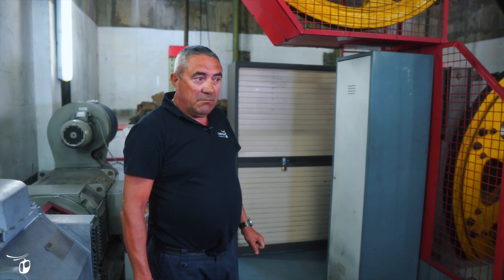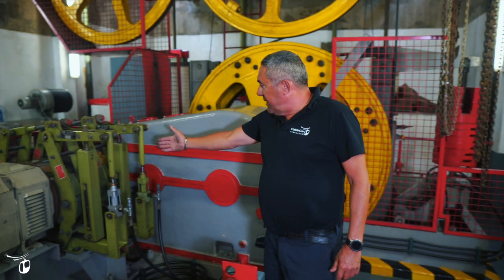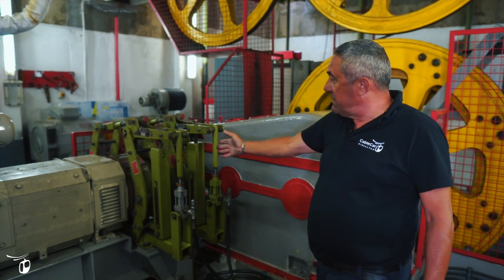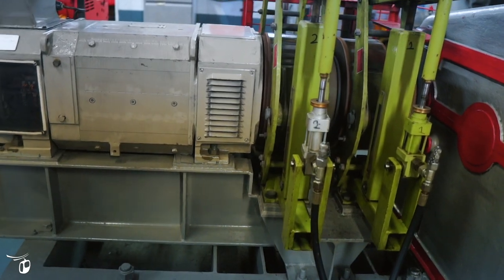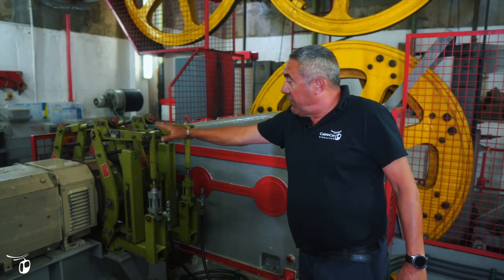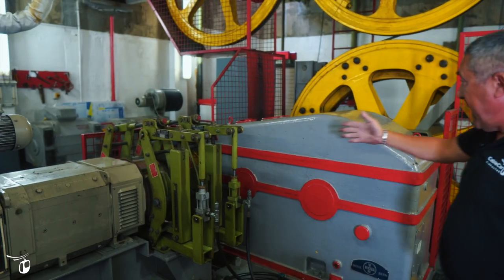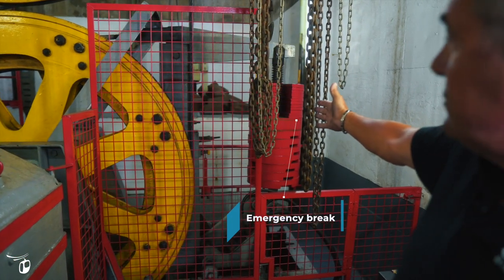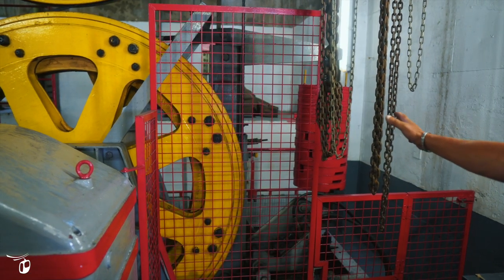It's a very simple system, but then again, it's a very effective system. Over here are the service brakes. As you can see, we have two. We always have two of each for safety reasons. We've got two brakes here coupled to the drive motor and the gearbox. If we need two, those will come on and stop the cabins. Having said that, we've got another brake over here just beside the bull wheel and whenever the cabins come into the station, that brake will apply and will firmly stop the cabins in the station so they won't be able to move.